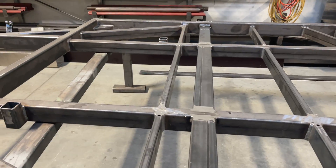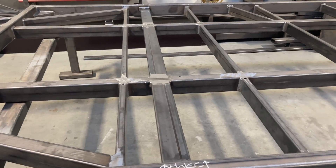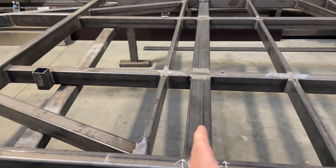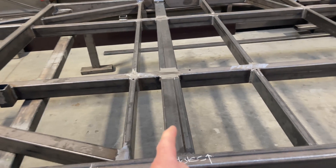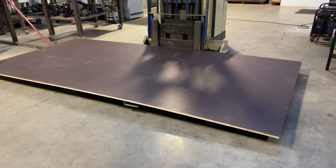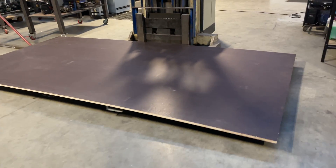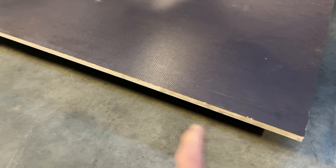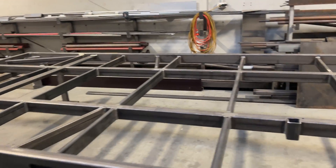The reason we've got this extra panel here is that we managed to secure a very large piece of the trailer decking we use, but even the manufacturer won't cut it to full length for us, so we still end up a bit short. We've chosen to put the join at the front of the trailer rather than have multiple joins. It's a single sheet nearly four meters long that goes right down to the end. The material is called Transtech 200 — a non-slip truck deck available in New Zealand. Once we've cut the sides we'll paint the edges so no water can ingress. It's very strong.